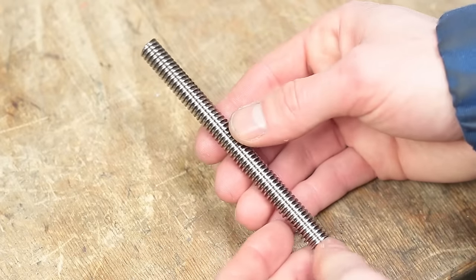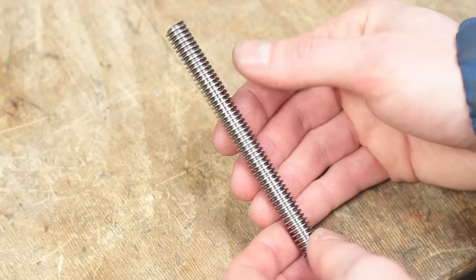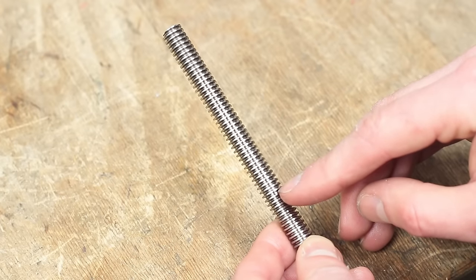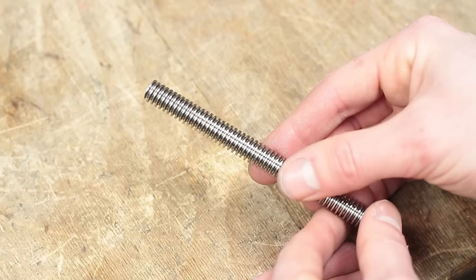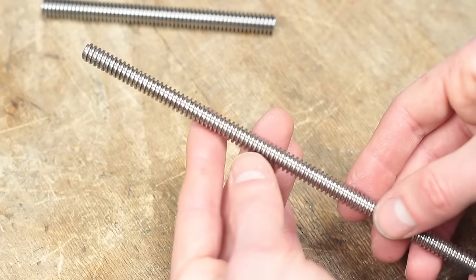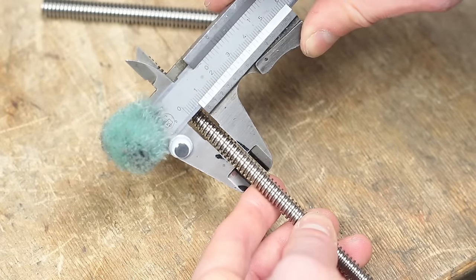In the opening shot of the first part, I showed you the spindle. This is a 10mm diameter Acme thread spindle with 2mm pitch — which I just realized after filming — it's a left-hand threaded spindle. It was a leftover from the cross slide modification where I needed a left-hand thread, but for the Compound Slide I need a right-hand threaded spindle. Luckily I had this spindle which has a right-hand thread and luckily the same 2mm pitch, but unfortunately it's only 8mm in diameter.